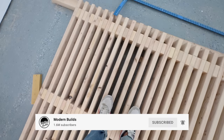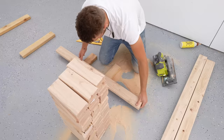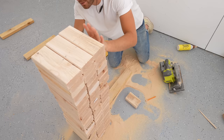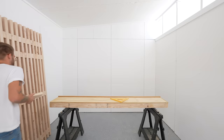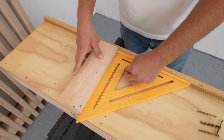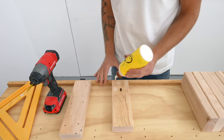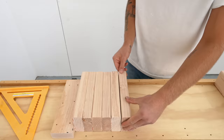By now I had used up the majority of my good 2x4 scraps, so I started cutting down some more boards into 10 inch long pieces. I'm going to be making 9 inch tall legs but I'll trim them to length later on. Overall I'm going to need 70 pieces. I'll be gluing and screwing these pieces together just like before, and I made this really quick jig to make sure everything went together square — just a couple of positive stops on one end of the glue-up as well as one edge, giving me straight reference edges that I could then trim everything square to.